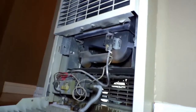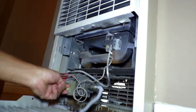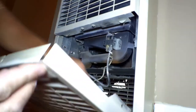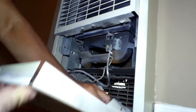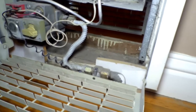So now I'm going to show you what to do to turn this off. The gas is right here, so first I'm going to turn this off. This guy goes like this — this is off. Now my flame is off. Gas is still on, so now I'm going to turn the gas off. Now gas is off. See that little valve — it's now perpendicular to the pipe, which means gas is off.